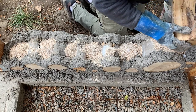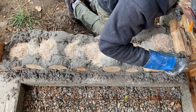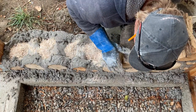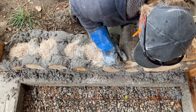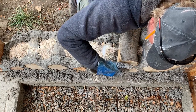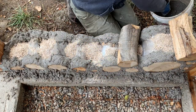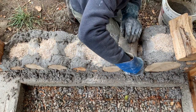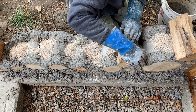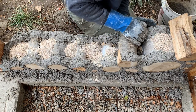By creating a complete mortar lacework, essentially, I'm able to prevent drafts and keep the wall stable. It's important to look down the wall and make sure that you've got a flush surface. If the parallel log ends are not straight on the log, the log can be tilted a little bit. I like to mash that mortar down with my thumb to make sure that I'm filling in completely around every log, and just continue applying the bead of mortar.